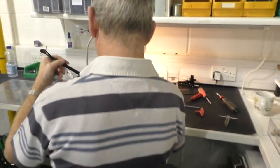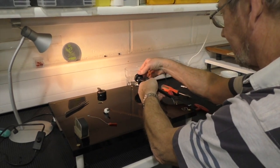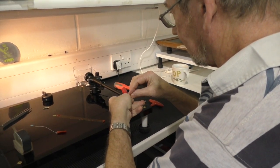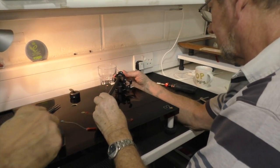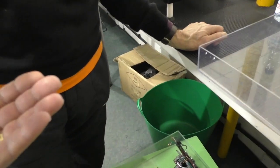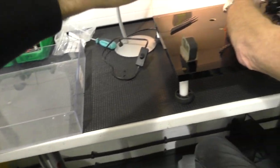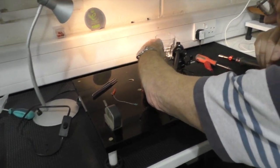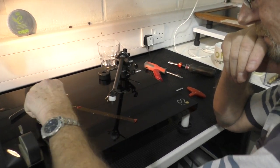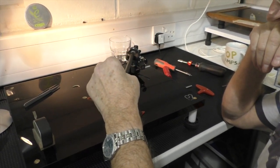Here's a test. This is a finished assembly. Every individual arm has gone through something like 20 or 30 different personal tests. So this is a final setup. You can see here the 20 milligram weight. That's the bearing friction and wire friction on all their arms. And once it's assembled, it will hold that tolerance — unless you use it as a hammer, or unless there's been a human mistake.